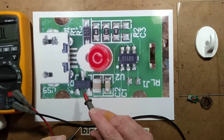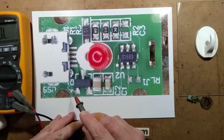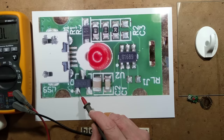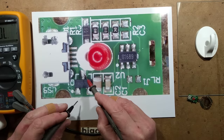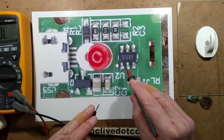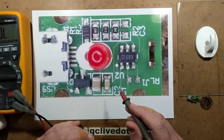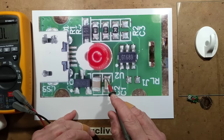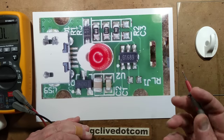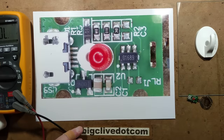The supply also goes to the chip via resistors, so the chip knows when the power has been turned off and on again - which is quite important. There's a big fat transistor here; one of the outputs comes down through plated-through holes to it. I tried finding this transistor's part number - it reads 'A00' or 'OO' - hard to test in-circuit because it's directly connected to the chip output and the load is almost a dead short. The two capacitors are in parallel: one is a decoupling capacitor with lower impedance to prevent glitches, and the other is a reservoir capacitor.